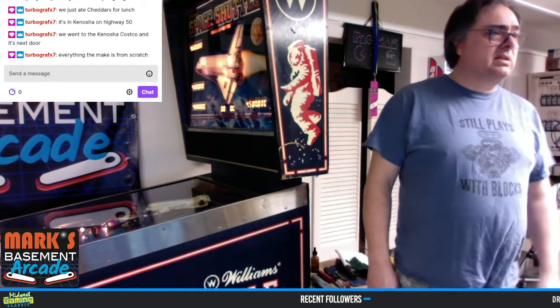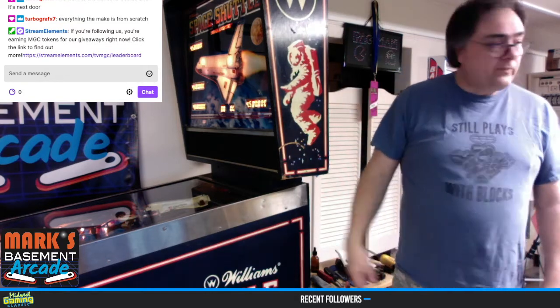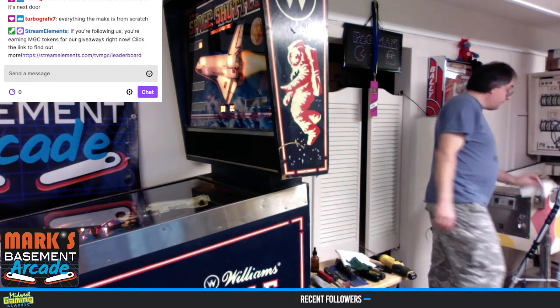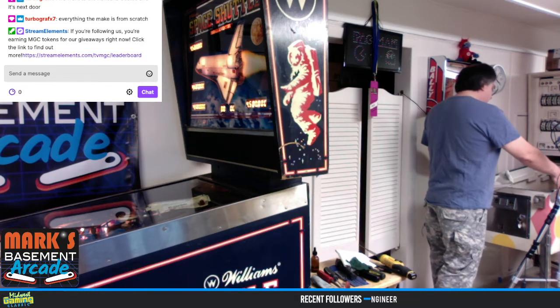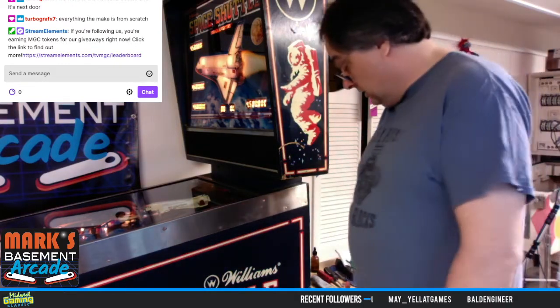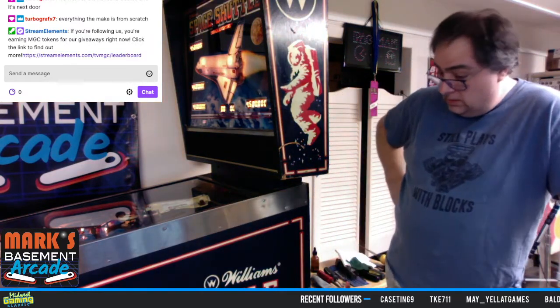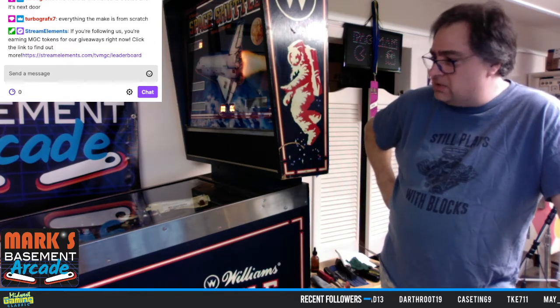It's not like the Sega high where the back is like way up here and in the front is like that. This is just, here's the apron on this one. Space Shuttle's about right there. So it's just like you're up higher playing it. I think it's got the wrong legs, but I used 2 of my brand new ones and then 2 good used ones that were the exact same size as the legs. So I'm thinking of putting the shorter Gottlieb legs on it to see if that lowers it. It just seems too high.